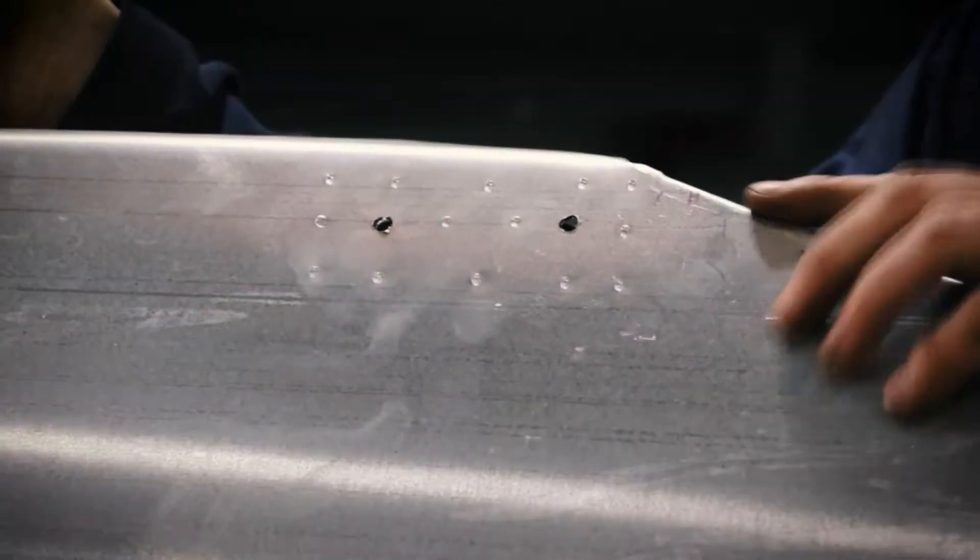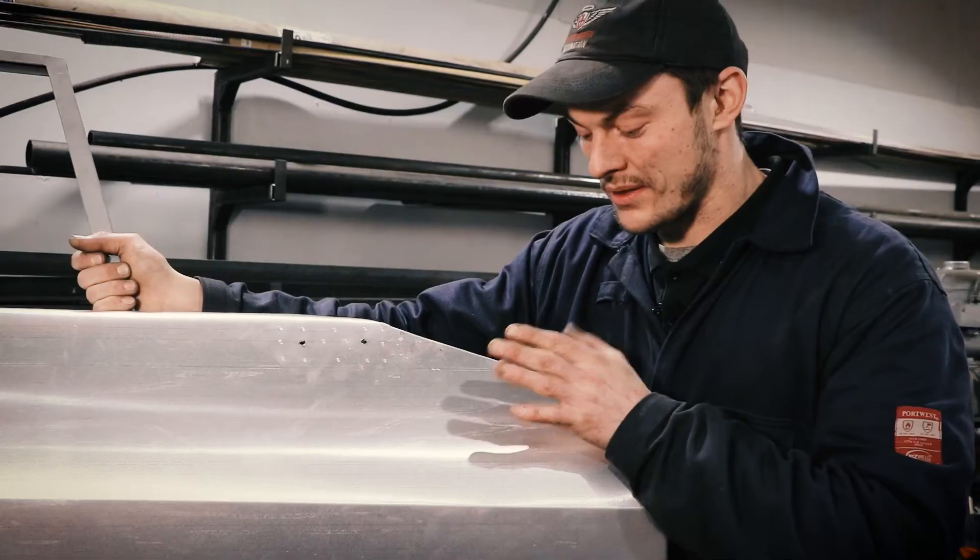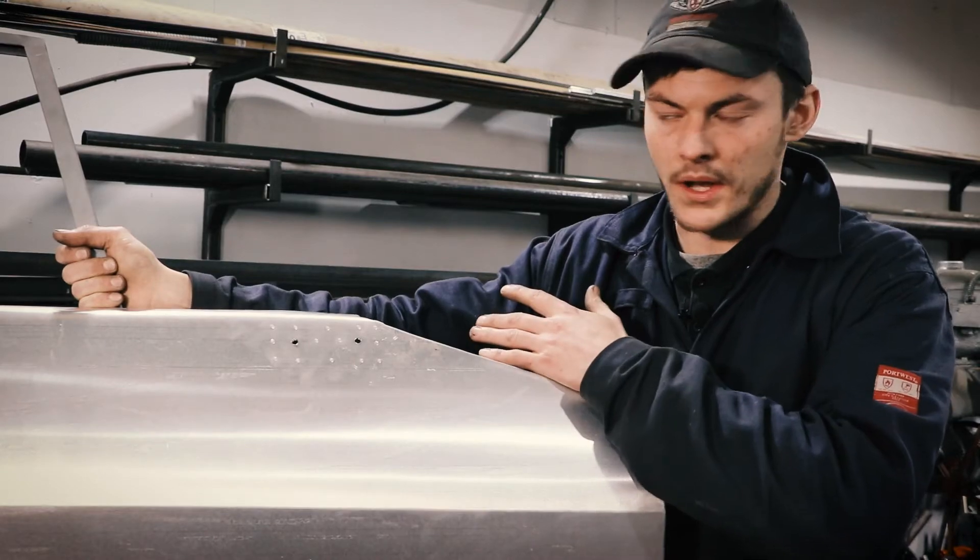At the front of the door we have the wing mirror and at the back we have the door handle itself, but the aluminium isn't as strong as steel so I've had to spot weld in a reinforcing plate behind it.